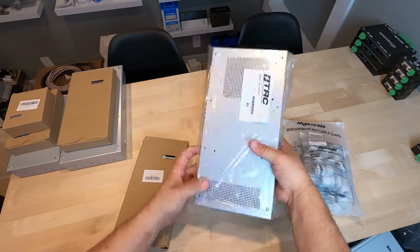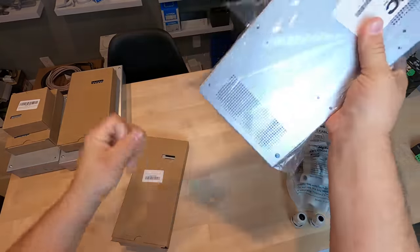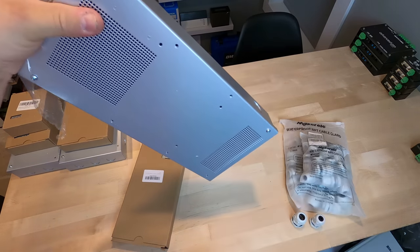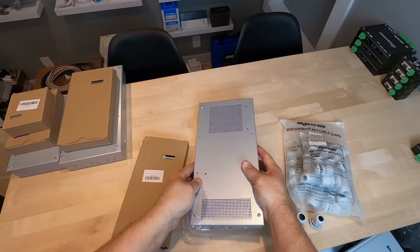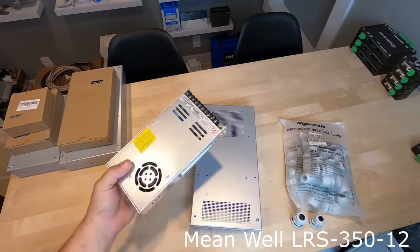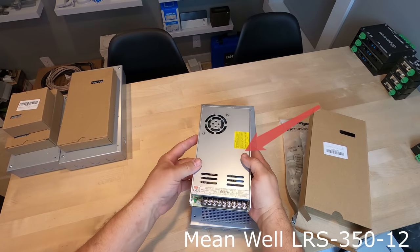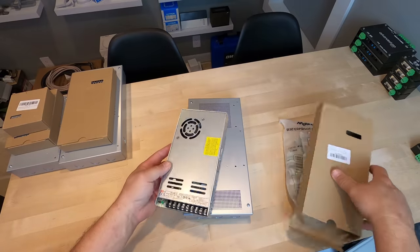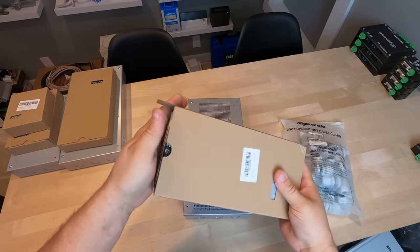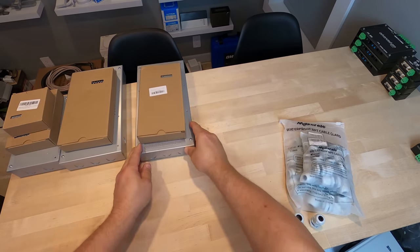This is our go-to — you've probably seen it in other videos we've done. This takes the LRS 350, which is a super common power supply. It is fan-cooled and the fan is loud, so don't mount it anywhere you can hear it within a theater room. It definitely needs to be in an equipment room. I should note: it comes from the factory set to 220 voltage and you need to flip it down to the more US standard 110/120.